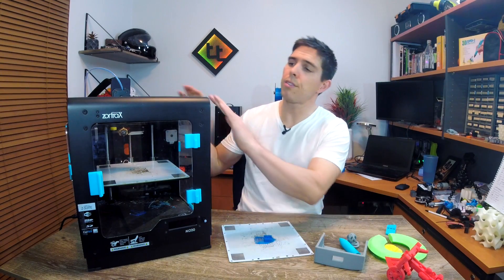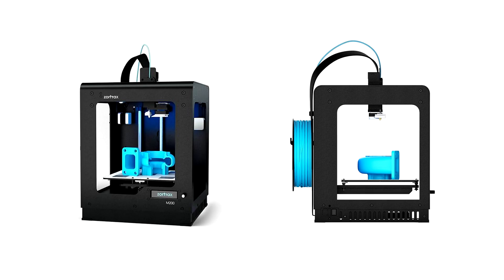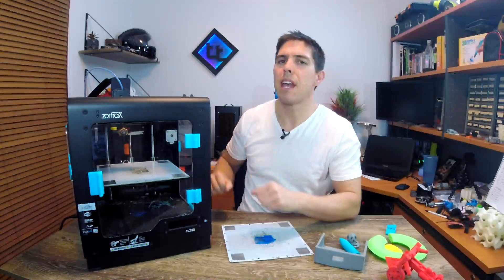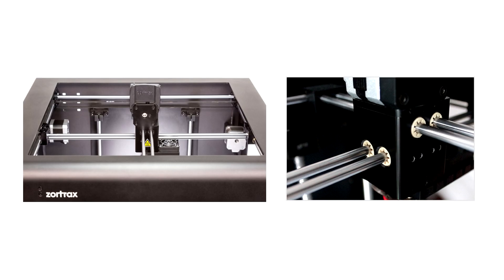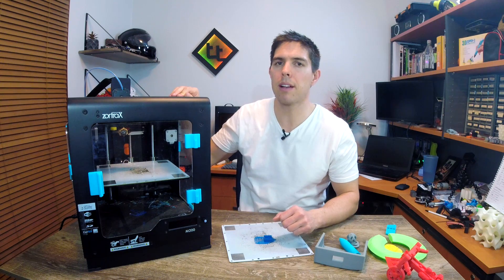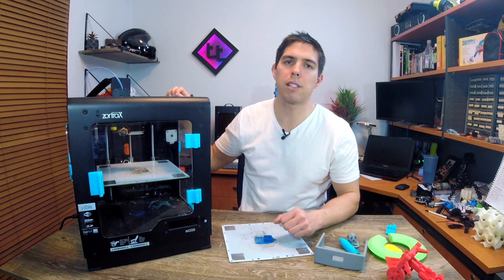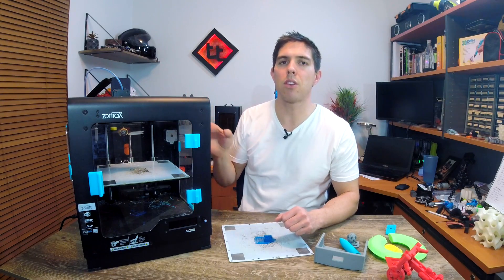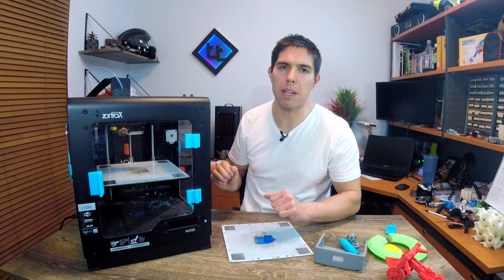This is a premium printer. Look at the frame — this all-metal frame is absolutely stunning. It's powder coated, and the shape of it, the appearance, how rugged it is — it's a big heavy type of printer. Mechanically this thing is excellent as well. It's got double rails for the X and Y axis. The geometry is much like an Ultimaker. It's got a ball screw for the Z axis. All of the mounts for the bearings are metal and they have nice screw clamp terminals to hold them in place. There's a lot of premium gear on here.